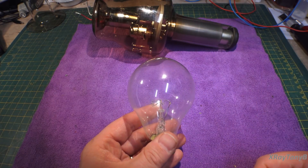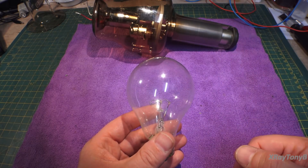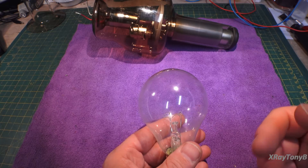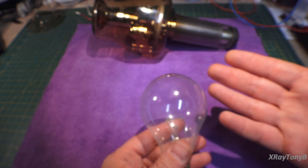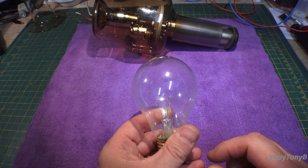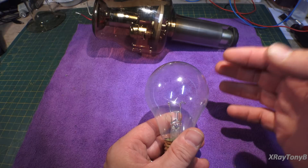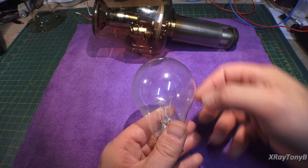This became known as the Edison effect, because the Edison bulbs were the first time this type of effect was noticed or recognized. Edison kind of cast it off as a nuisance, but others picked up where that left off and realized there had to be something causing it. What it was — we came later to find — was that as the filament got very hot, it would release free electrons, making a cloud of electrons around it. Those electrons could be attracted to a positively charged area, causing the glass to discolor, with little particles of the filament impregnated into the glass causing that shade.